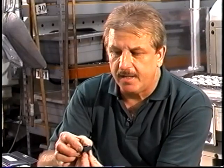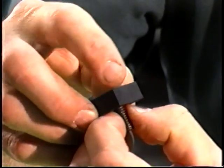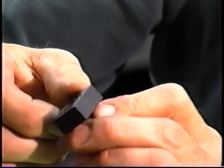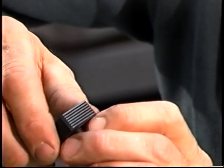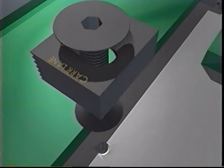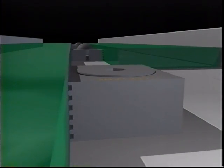This is designed so that where you put the clamp, if you are machining aluminum parts, it has a smooth side on it, and the other side of the clamp has a serrated jaw so it will actually bite the part. If you're doing steel and want to really grip it — or aluminum where you don't care about the finish — it has an either-or option depending on what you are machining.